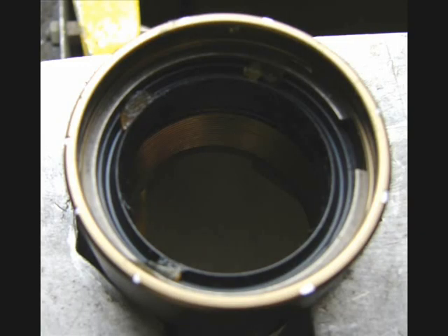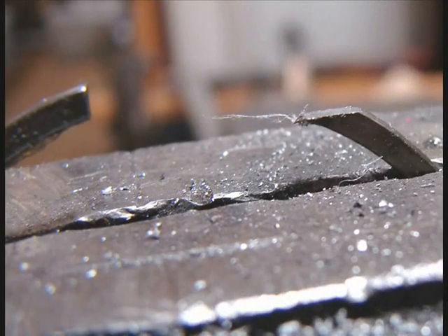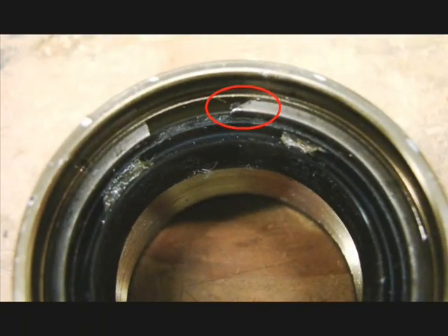Here are a few still shots to give you an idea of what you're up against. Looking down into it when it's assembled, you can see closely that it's just a butt-edged circlip. I'm pointing to it there. This is how I grind off one side at an angle — a little more than 45 degrees actually. Here I show what it looks like when it's back down in there, up close. That way you can get under it with a small screwdriver anytime you want to work on it in the future.